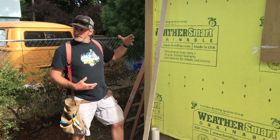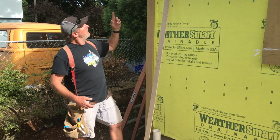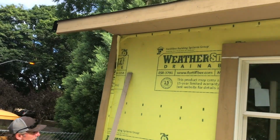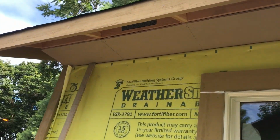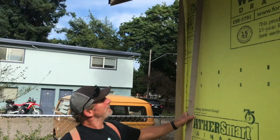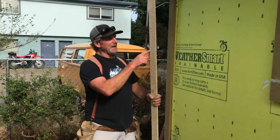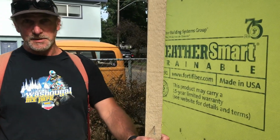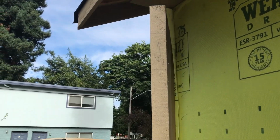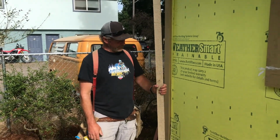What I'd elected to do for this house, and that one, is we have the soffits in there, which you have to have before you put the siding up. And I'm assuming that it's a level plane up there. So I built myself a story pole. It has marks on it indicating where I want the top of each course of siding to go. And we actually saved these from the last building, since these two are the same.